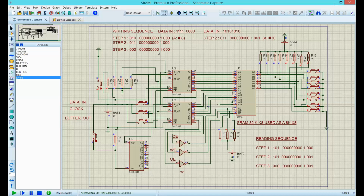Right there. Now put the 1, 2 zeros, and a 1. Yes, go. It's 16. Now I hit this. Disable the chip. Everything here is being controlled by the pull-up resistor because I'm not using the push button. But now it's in disabled state.